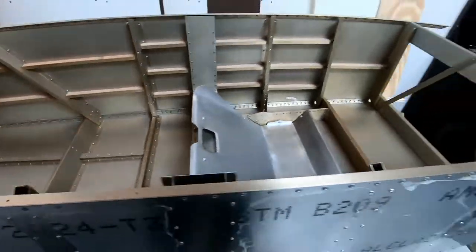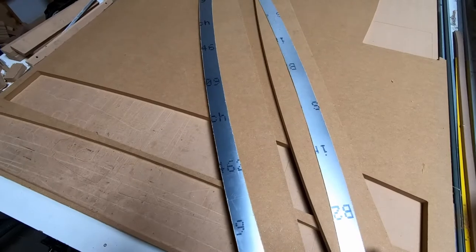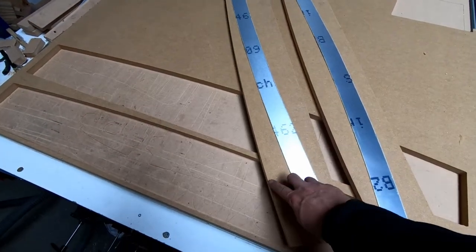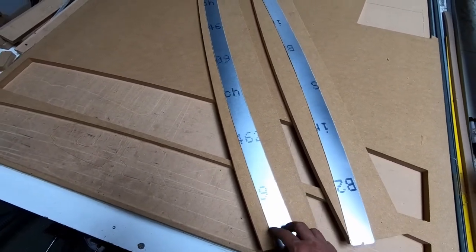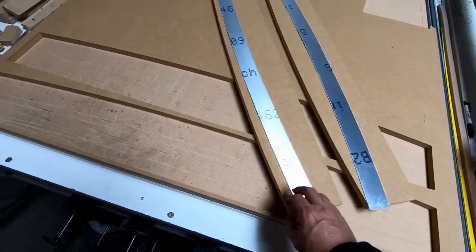So what I'm going to do is just go ahead and bend these real quick. This should go fairly easily, so it's just a matter of getting these clamped, and I do have to radius the edge here where the bend's going to be a small amount. But I'm just going to use a rubber mallet to try and bend these over very carefully and try not to make too many dents in it, because it will show